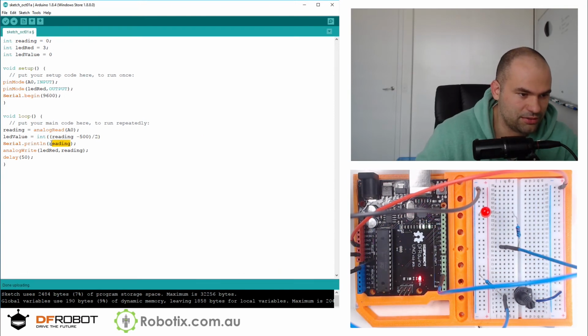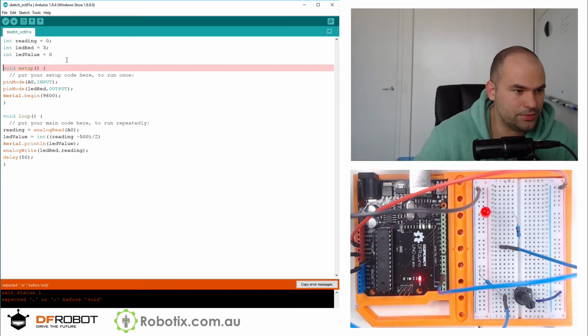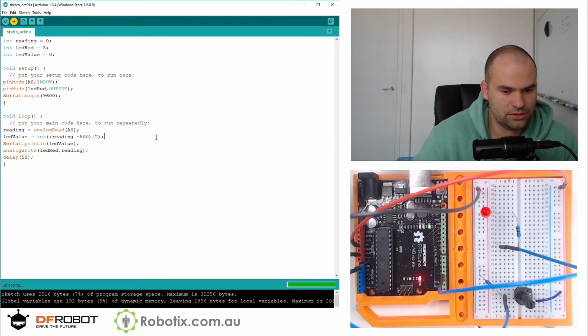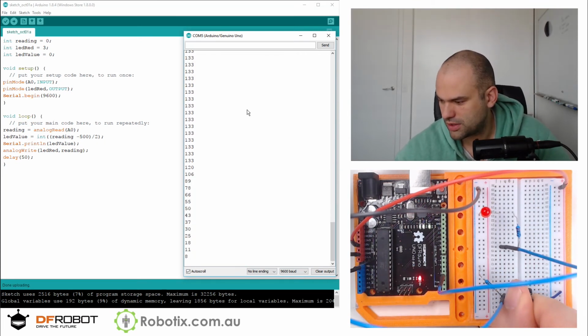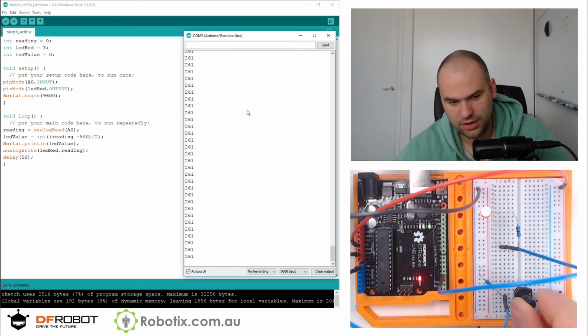So serial print. I think we're going to have a working potentiometer here that's going to take our LED from nothing to something. Okay. So moment of truth, 137, pretty low. So the lowest, that's 261, and oops, 712. So if we crank it going this way, we are going to go past 255. 261 is still strong.